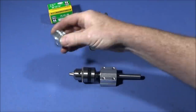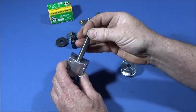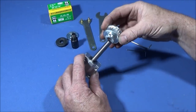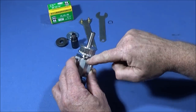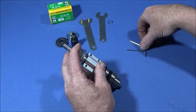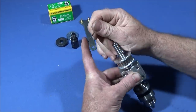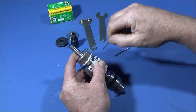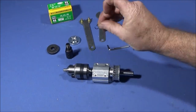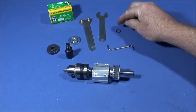If you're going to use the drive assembly, you can orient the pulley either way, but first put one of these metal C-clips down over the shaft so it rests against the inner part of the bearing. This prevents the pulley from rubbing against the bearing housing or bearing outer diameter. Hold it in position and tighten with the Allen keys provided — there are two grub screws. You can have the pulley oriented either direction. The kit comes with two C-clips; the second appears to be a spare.